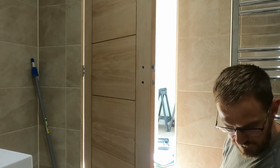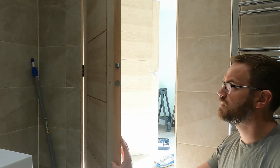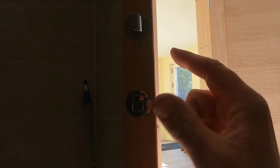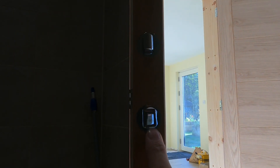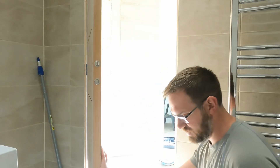That's it - lovely. So that's two fitted. It's just a simple 25mm hole, 16mm both sides. Spindles match up all the way through there. And then you can just carry on and fit the latches and the handle.